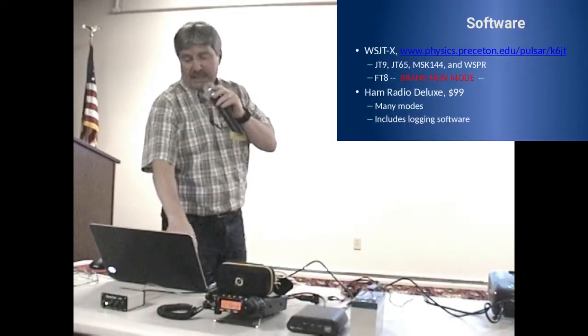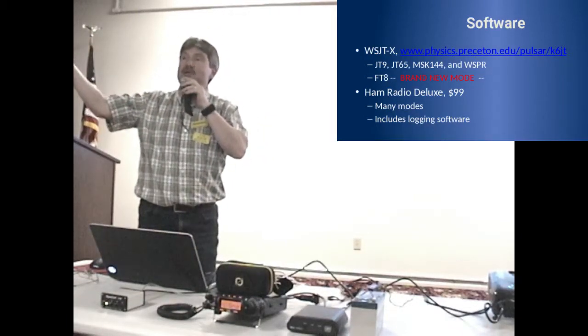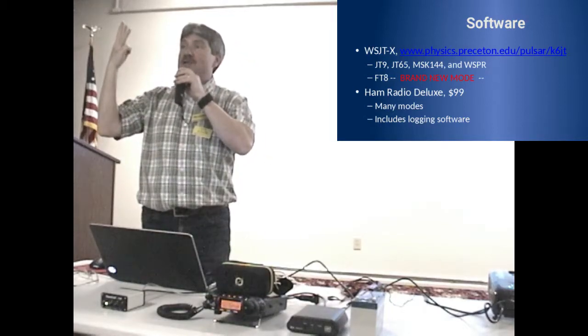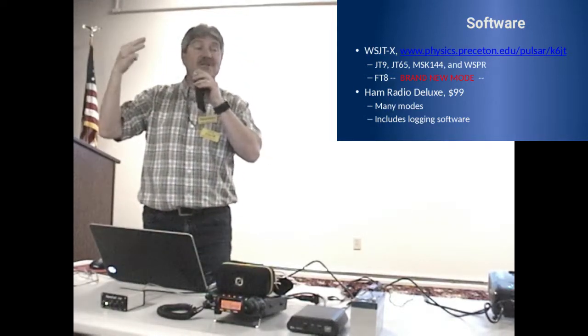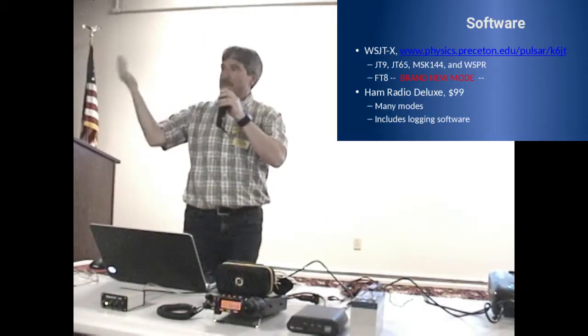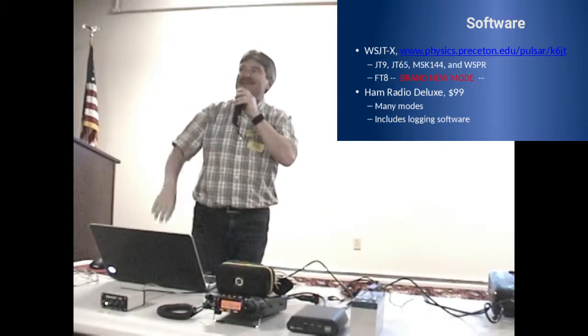Just a little bit on the JT9, JT65, you send for 1 minute, and you receive for 1 minute, and a standard exchange is 3 exchanges. So that's 3 sends, 3 receives. That means it takes 6 minutes to send a message, make an official QSO. And a good cup of coffee.